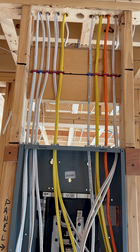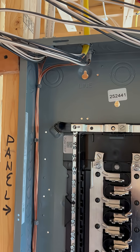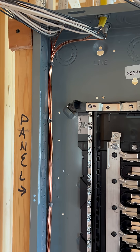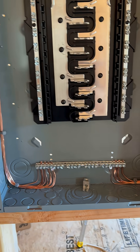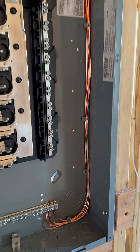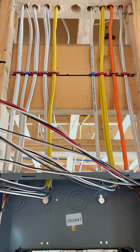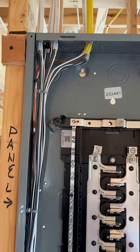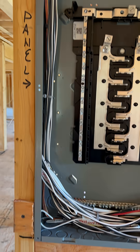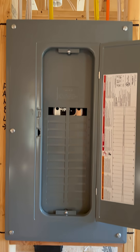When you're doing this by yourself, this is the way I do it. I cast a nice level line 12 inches from the panel to get my proper securement required by code. I staple everything nice and neatly, get all my wires brought to the side of the panels to keep them out of the way, and then I like to put my ground bars on the bottom during new construction — all you've got to do is pull the panel cover off, your grounds are right there with plenty of access. Then I tie-wrap my wires to get everything nice and neat.